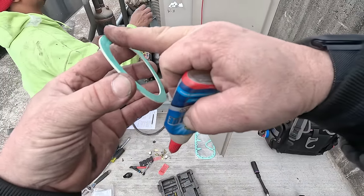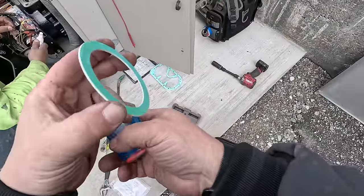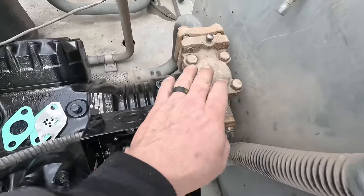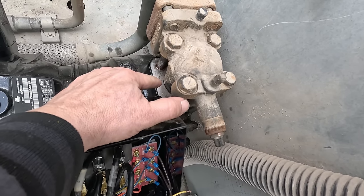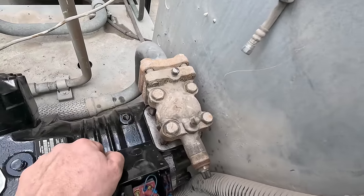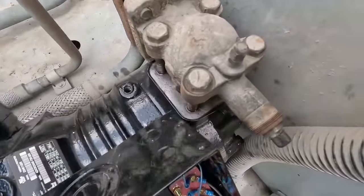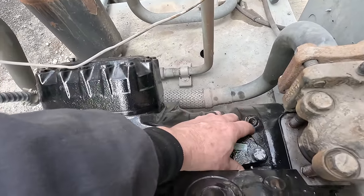We got some white stuff there, I got some pipe dope. We got this in there, we got that new seal — top and bottom of the seal. We got the nylog on it, went ahead and oiled my bolts so it got nice and tight. I went ahead and front-seated that valve so we're actually isolated — not just sitting there absorbing moisture. So I'm going to go ahead and peel this off, get the new one on, finish wiring things up, and eventually we'll start getting this system under pressure and do a leak check on it.